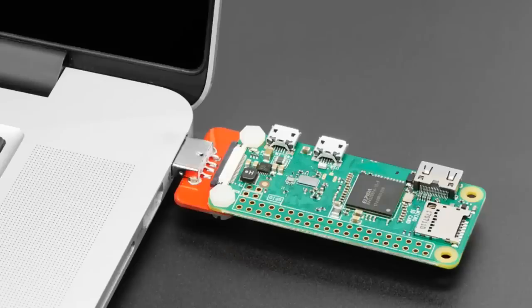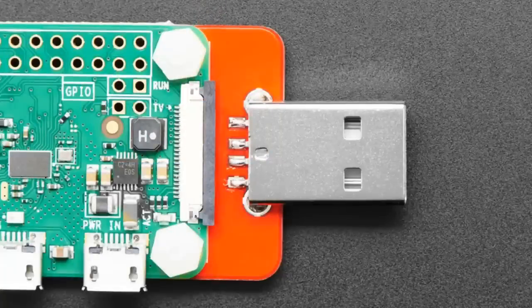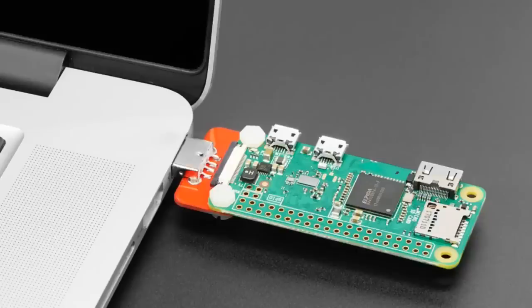The Raspberry Pi Zero can act as a USB gadget. When you plug it in, it acts like a USB client because the USB pins can be host or client mode. This is a little PCB that you fit onto the bottom. You have to solder it at four points: V bus, ground, D plus, and D minus. Then it comes with two plastic screws, and when you plug it in, the Raspberry Pi Zero acts as a USB dongle.